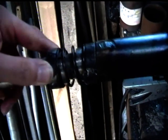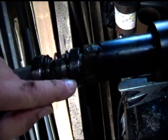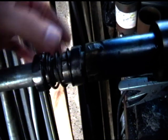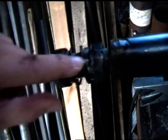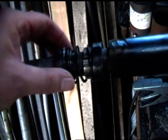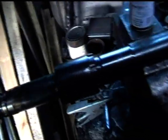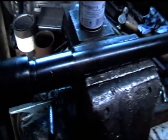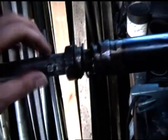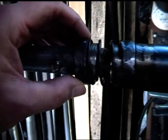You can see how that operates. It's two pieces of steel pipe, then I've wrapped flat bar around it, I've welded them on, and I've just tack welded the spring in two points near its end so that it stays part of it. Now that basically moves around on the bar here, and I don't want to move this around too much. I've just blued this barrel. Don't want to scrape it up too much. And there's the little locking lug on the bayonet fitting, which goes into the barrel there.